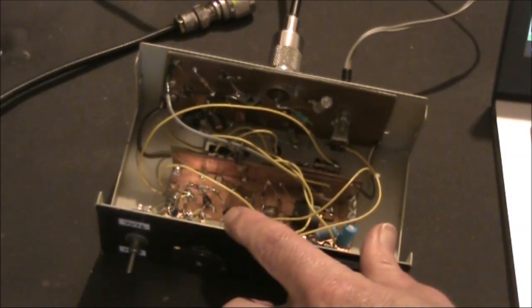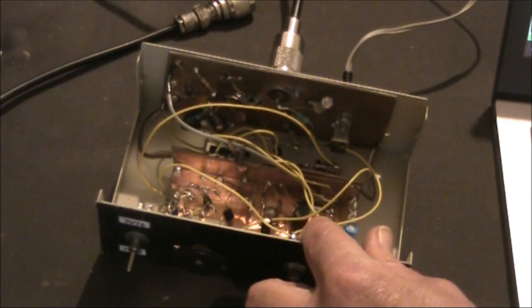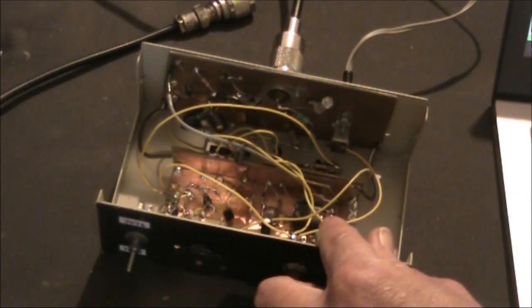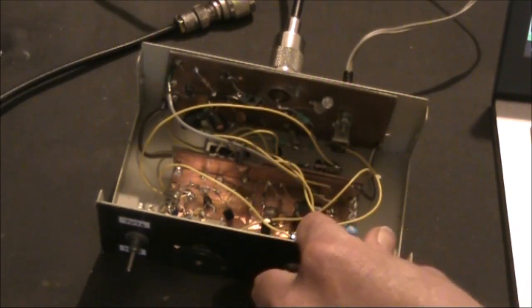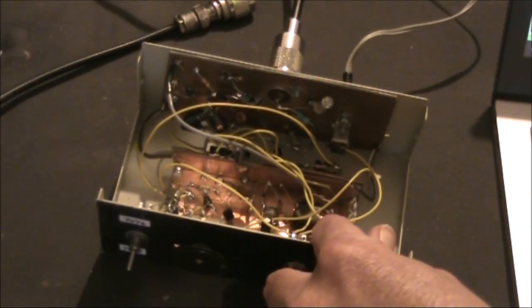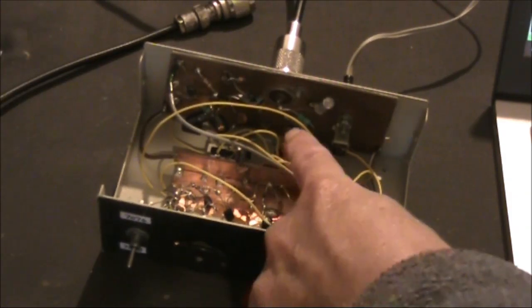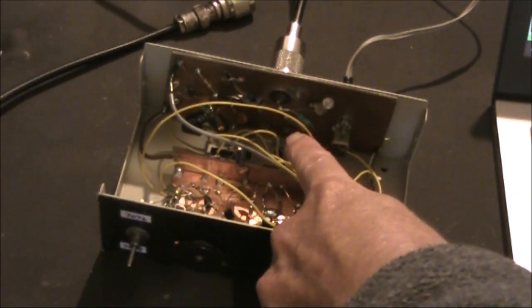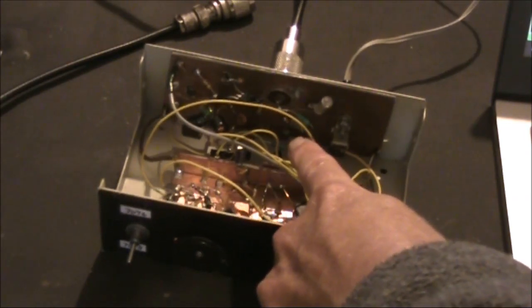The other circuitry used is a voice operated transmit — or in this case a sound operated transmit — that automatically sets the transmit-receive relay to transmit when a signal is coming from the computer. That's two transistors, two BC548s, which drive the relay. Finally, connected to the antenna connection is a low pass filter to cut off any harmonics above 7MHz.